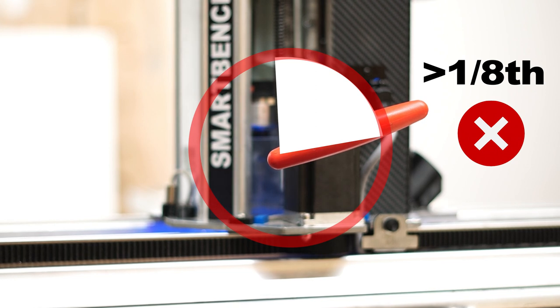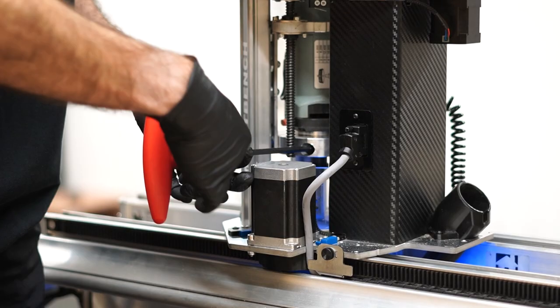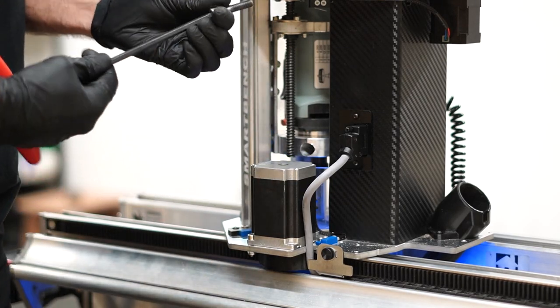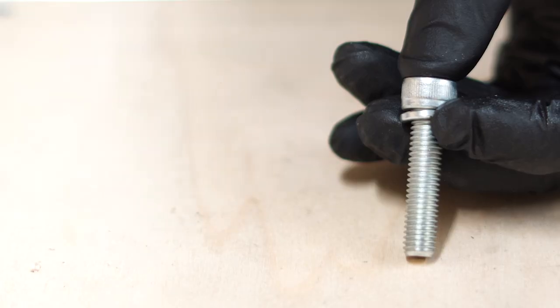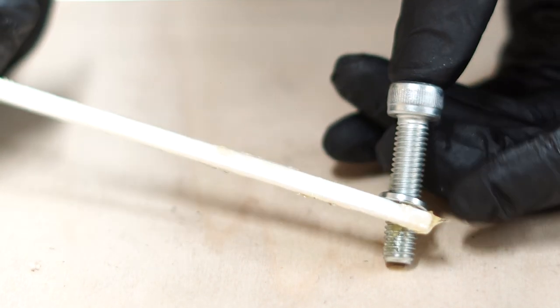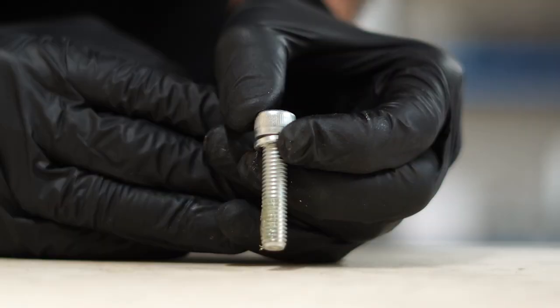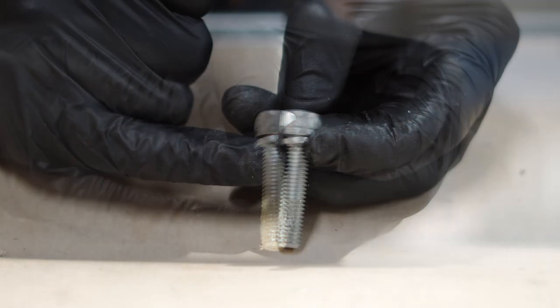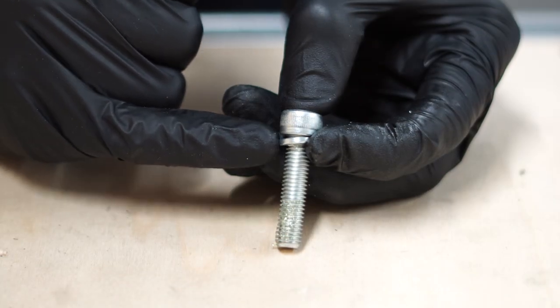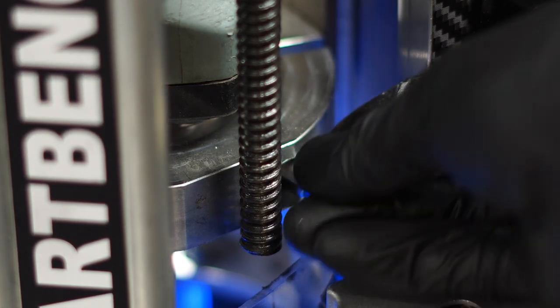If you have trouble achieving this torquing accuracy, you may want to check the cross bolt lubrication. To do this, remove the cross bolt using the supplied T-driver. If the threads are dry, apply a thin film of lithium-based grease — the same grade applied to the Z-axis lead screws. Only apply grease to the end half of the bolt. This ensures that the spring washer remains dry, allowing it to lock when tight. Ensure that the spring washer is in place under the bolt head and then reassemble.